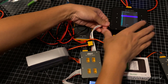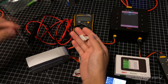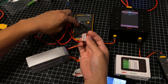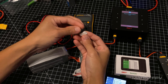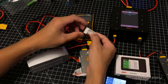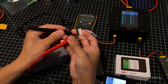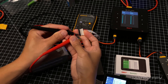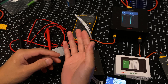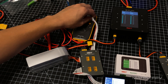If you don't have a fancy setup like this, what you can do — if you have another balance lead — is just connect that part to a multimeter. I'm using some header pins, but you can use hookup wire or anything like that, just to have your multimeter read the values from here. Read from cell one, which is from the most negative side — this white part — all the way to the positive lead. It hovers a little, but we're going to three decimal points, which is kind of overkill. Two decimal points is fine; as long as the first two decimals match, you're good.